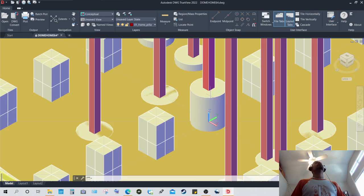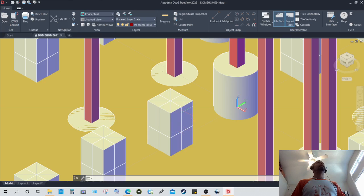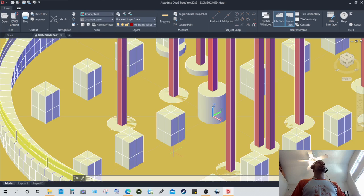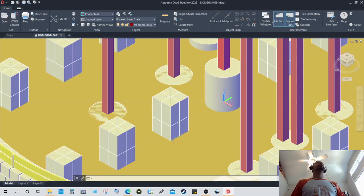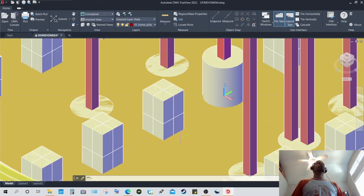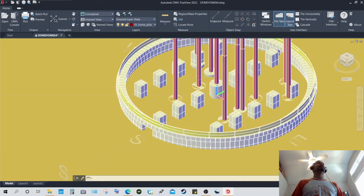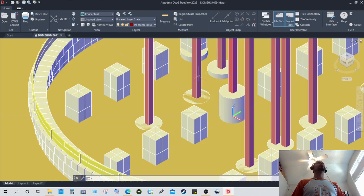Of course, you can see that middle foot, concrete foot, is in line with these, providing support for the floor frame. Unlike these concrete feet or pads or bases, which are only a few inches into the ground, they pretty much provide footing on packed ground for the floor structure. They don't necessarily provide the side forces support that these would have to provide. Those provide support for side forces, side pressure, such as me pushing on that column from the side.